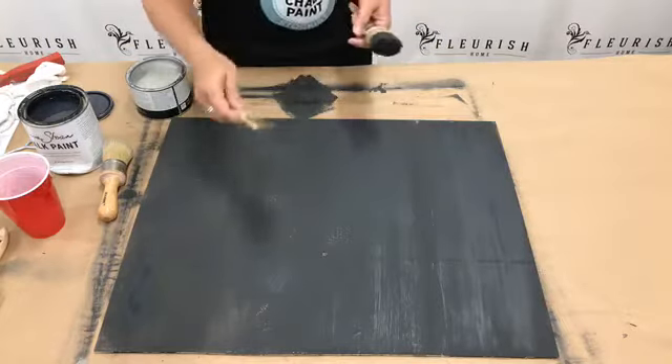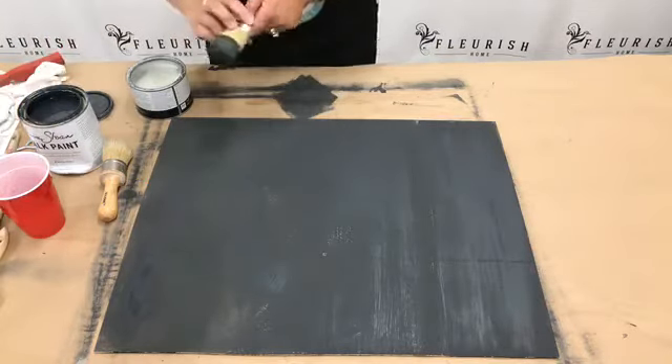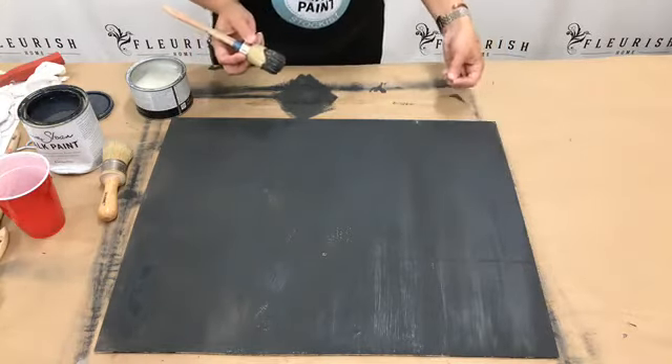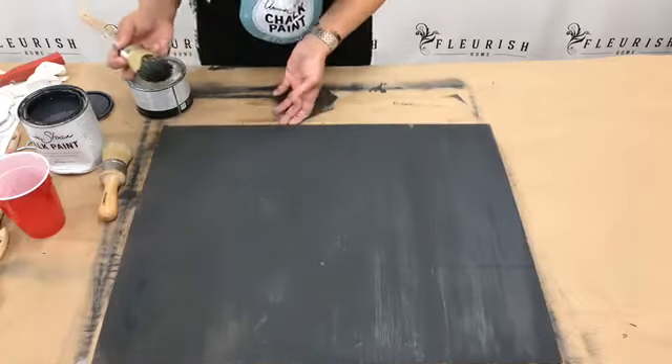You're getting better coverage and I cannot see my brush strokes here where I can see my brush strokes on the other side. Why do you need to use extra paint on the synthetic brush? Because the paint is such a heavy body paint, it won't push far enough. The synthetic brush is meant to lay down paint because latex is meant to just be laid down — that's the design of the brush.